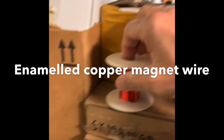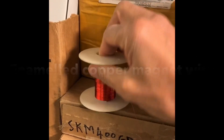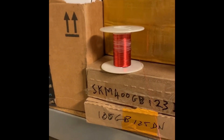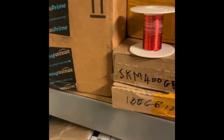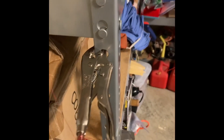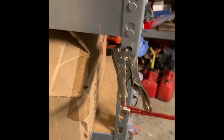This stuff has 30 gauge wire on a spool. You can use thinner wires, but there's a higher chance that they might break when you're making the Litz wire. To make this Litz wire, I've got a couple of grip wrenches stuck on the shelving units in the garage. Wrap it around a couple of times and just start walking back and forward — it's like exercise actually. You can do that a few times.